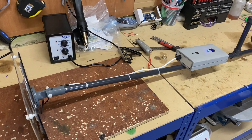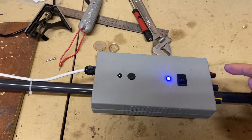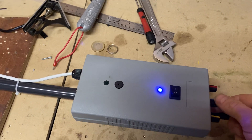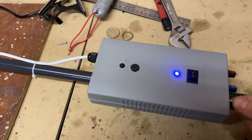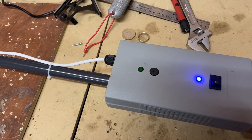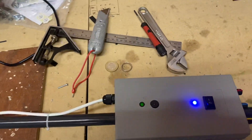This is a lab bench test of the metal detector I've just built. The red is the frequency, the blue is the fine adjust, yellow is the coarse adjust. The setting you want is just crackling — just off — and we'll try some bits and bobs.